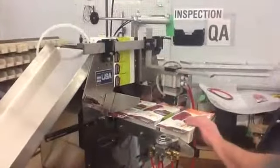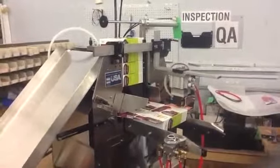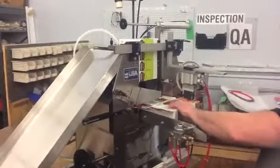After the first two cartons are in place, the following ones are automatically debossed as the leading carton enters the chimney and initiates the auto cycle feature, which also applies the hot melt glue, lifts the elevator plate, and cycles the discharge cylinder.